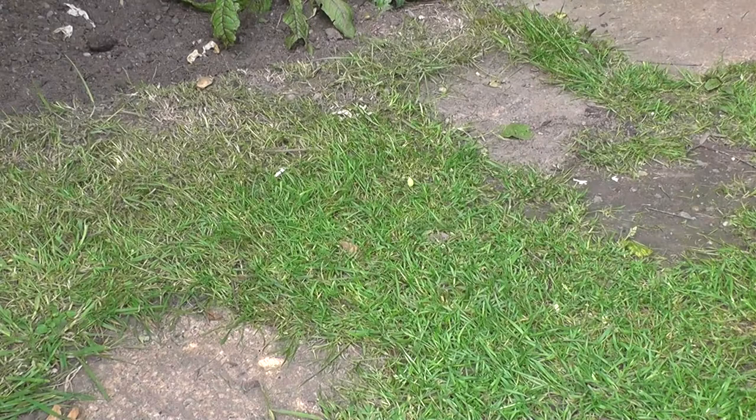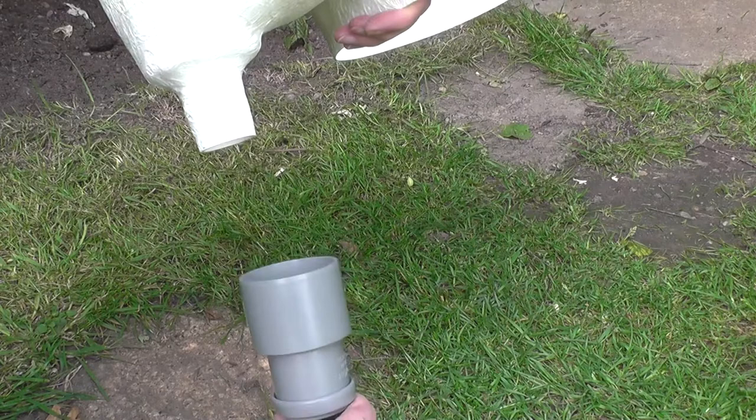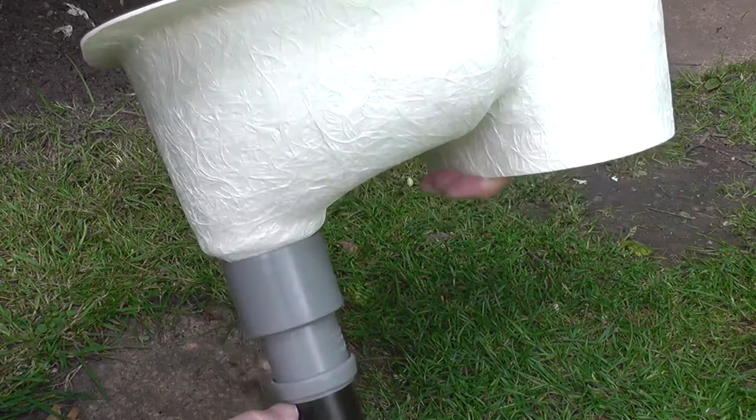In another video I'll talk about what to do with the urine, but if you're diverting the urine somewhere else, I use these standard plumbing parts. This would be fixed into place inside the toilet so when the hinge of the top of the toilet came down, that would connect, and then this pipe here would lead off to a soakpit or something like that.